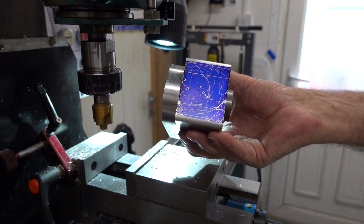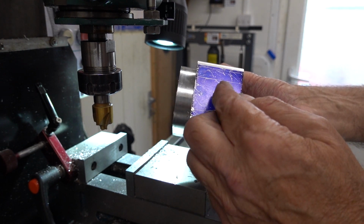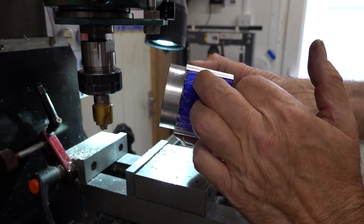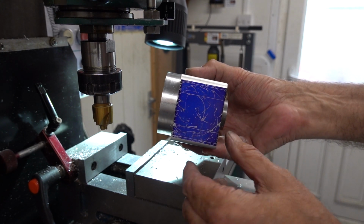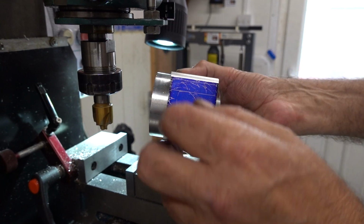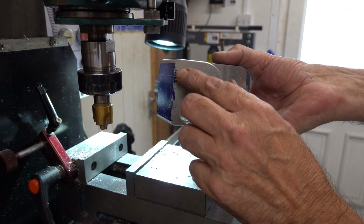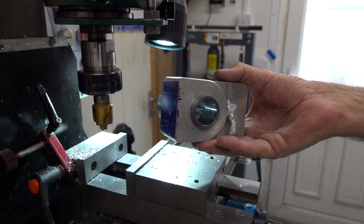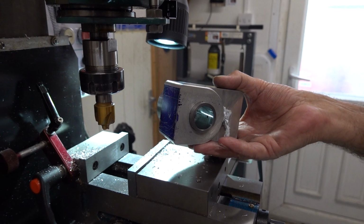Now, these holes, I've got to be very careful because there's a water jacket in here, and near the front is the slot. So my depth of the 2 front screws can only be 10mm deep. I'd like to say 9mm deep, and then plug tap. The M5, the back two, it doesn't really matter because I've got all this meat at the back, so we can sort of go to it. I hope I'm holding this high enough. I can see.